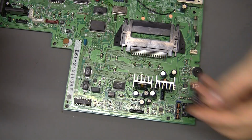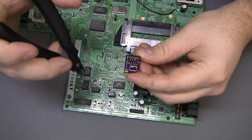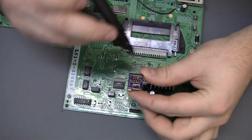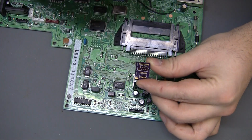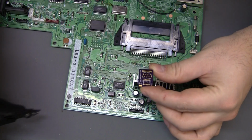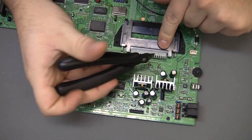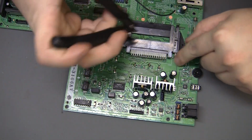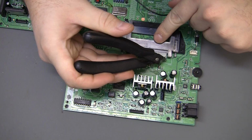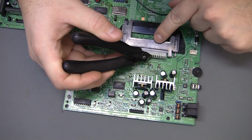With this circuit board, I am actually going to capture pin 18 as well. So I've got pins here for 15 through 23. Okay, so basically you come down here and you look for pin 15, and the longer ones, there's a marking right here, it says pin 1, so the longer one is pin 1. So every other one is an odd 1, 3, 5, 7, 9, 11, 13, 15. So 15 is right there.